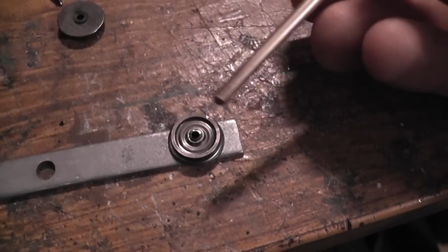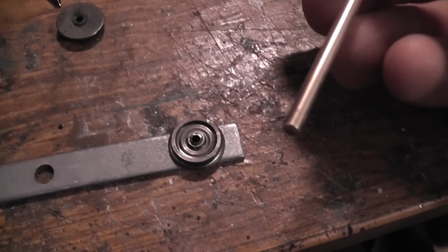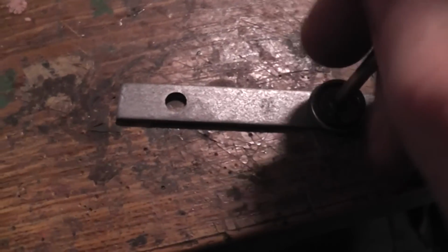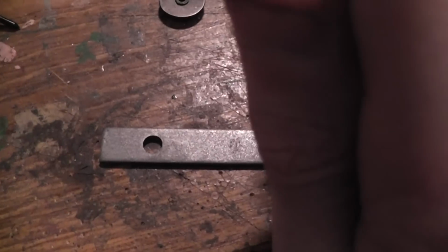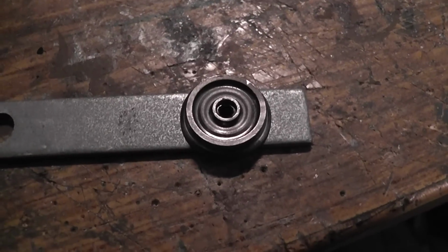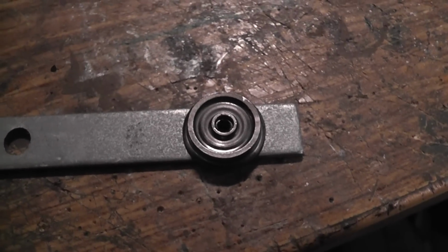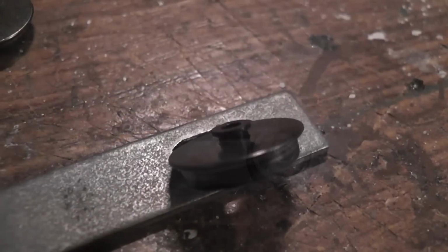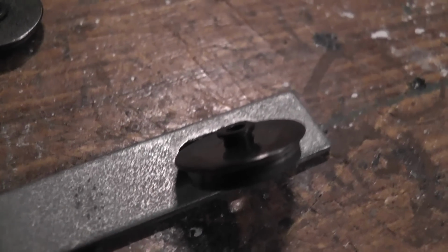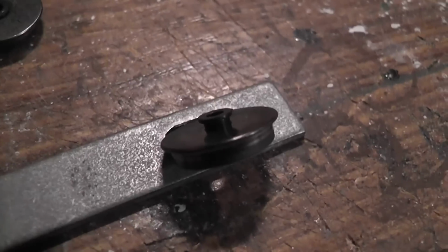So I've got the end of a back-to-back wheel gauge, which you can see is a tapered fit, and it should go on the end there. There we go, that's just punched it down a little bit, and now it can be levered out from the other side. You can see where the bush goes in, it has like a little sort of top hat part, and you can lever that with a screwdriver, and that will pull the bush out.